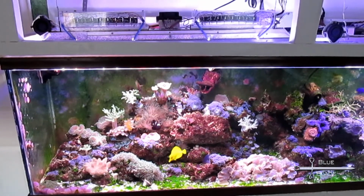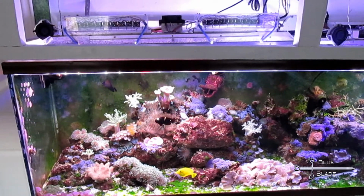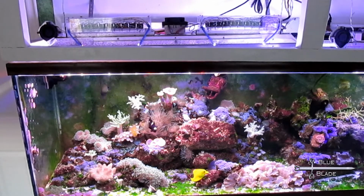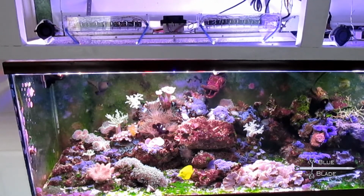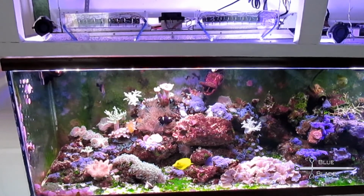But one lesson I could only learn this way is that apparently at least one of the failure modes can dump voltage onto your PWM line. This is a bit of a concern because the lights run on 12 volts and I don't want a lighting issue to fry my Arduino. Eventually these will fail. There are enough of them, one's bound to go sometime.